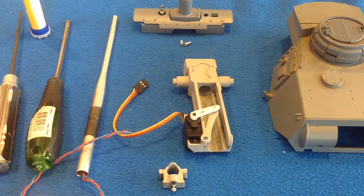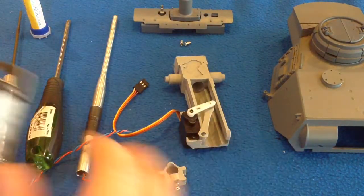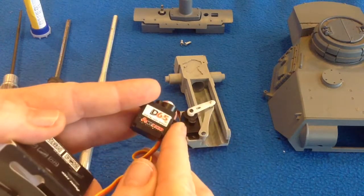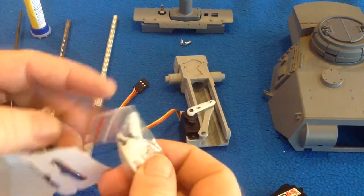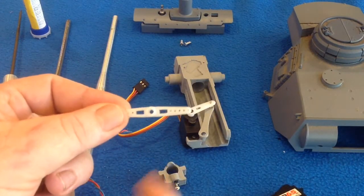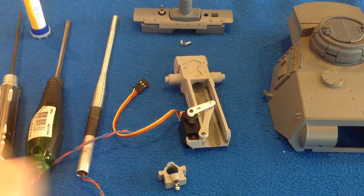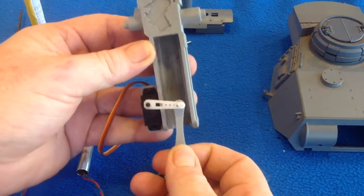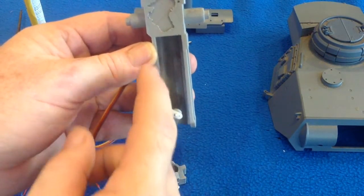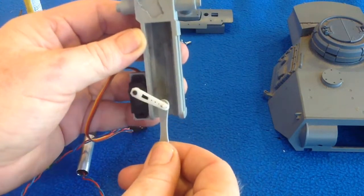You might also need to print off some servo arms. I like to use the D65 servos from Power HD — they're fairly cheap digital servos. The reason I particularly like this servo is because it comes with a nice long servo arm, which I cut one half off. The length of the servo arm is important to get the best recoil action — you want to try and get the pivot point in the centre, in line with the centre of the gun. A short servo arm would be off centre, but these longer servo arms mean that the majority of your movement is going to be down the centre of the barrel.